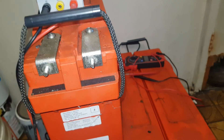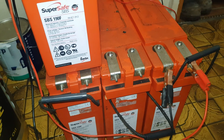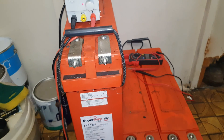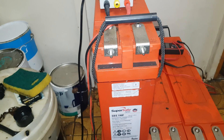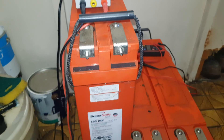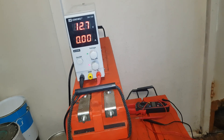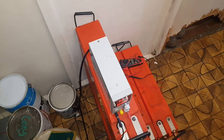These are going to be one part of my 24-volt system. I did think about 48 volt and I've still got a 48-volt UPS we'll play with, but I'm going to start with the 24-volt inverter. With two of these in parallel and then twin series, plus the two existing 100Ah batteries in parallel and twin series, we'll effectively end up with 380Ah from these and 200Ah from the others - 580 amp hours at 24 volts. That's starting to get serious storage.